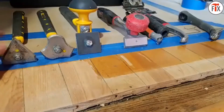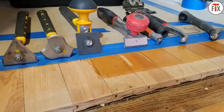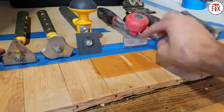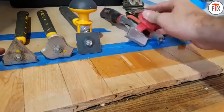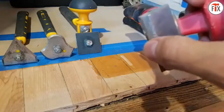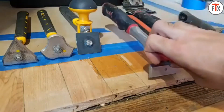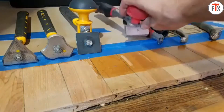One thing I like about the speed heater scrapers is that when you're scraping softened paint, you have a nice thick blade for the paint to evacuate. The carbide scrapers tend to get a little clogged up because there's only a small angle to the blade, so the paint tends to get clogged under the edge and just glides across, leaving it smeared.